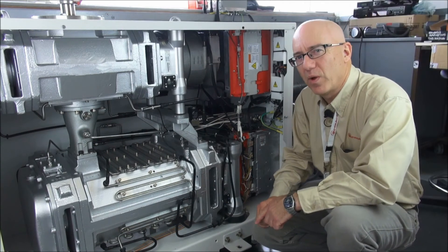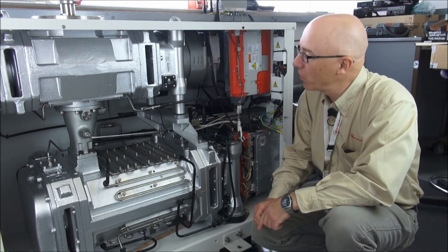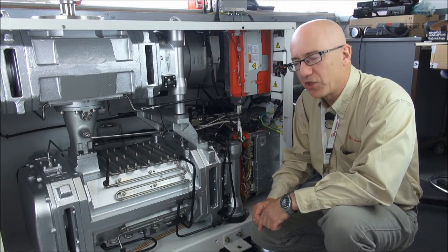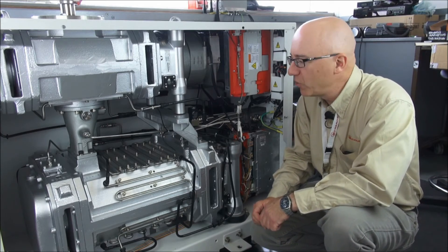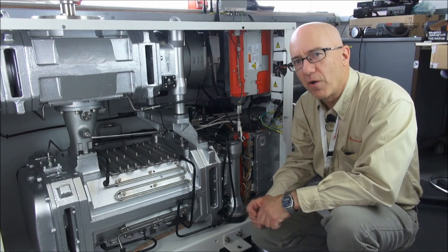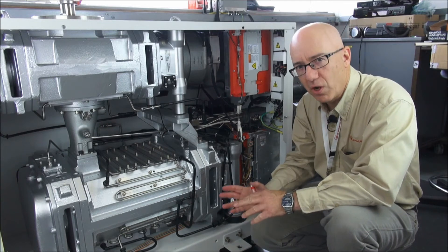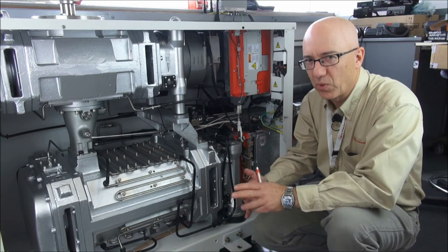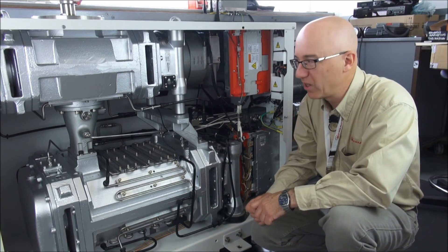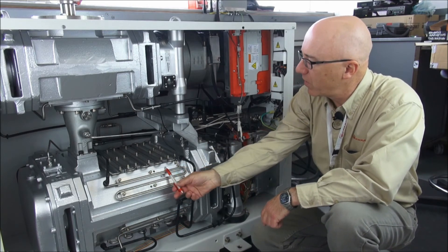The GXS is fitted with a water cooling system which regulates the temperature of the screw pump, the motor and the inverter for efficiency. The entire water cooling system uses narrow bore tubing in stainless steel or composite material which is switched on and off to maintain high flow rates through narrow volumes, so there is no requirement for any water jacket with the consequent risks associated with large volumes of hot water, particularly through cast iron materials. The dry screw pump is cooled with these stainless steel tubes as you can see here.